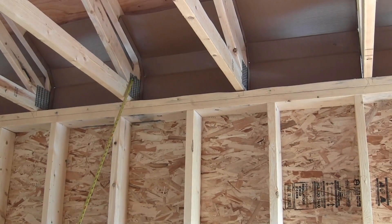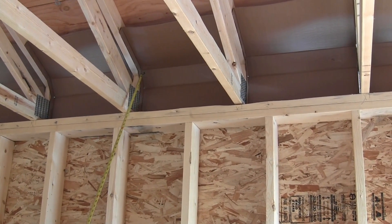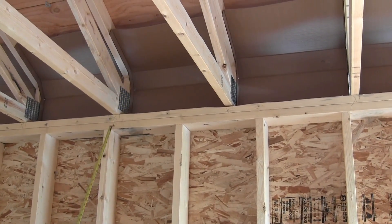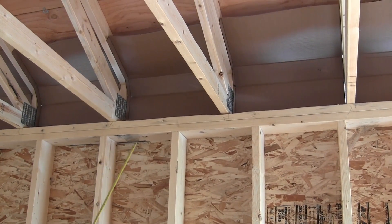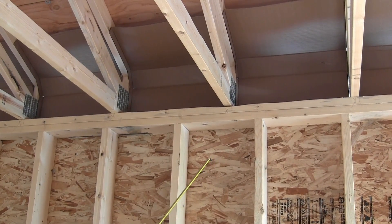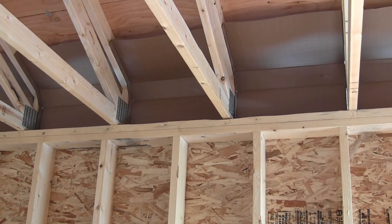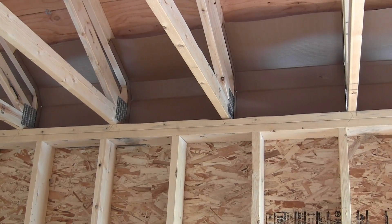These ones are considered a 12 inch heel, so I get twice as much insulation above my wall where it's critical, and I still have a one inch gap between my insulation stop and my roof sheeting to allow for airflow. It minimizes heat loss and maximizes your efficiency if you go that route. Just an idea to keep in mind for future use.